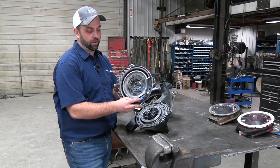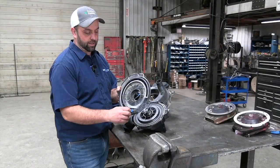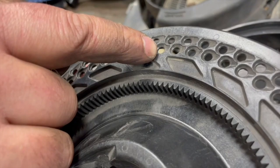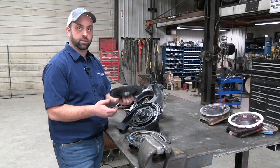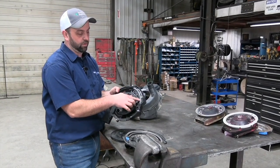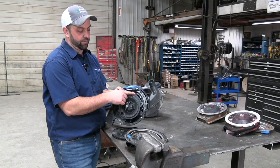Our second issue is our ejector wheel. These little stars — this is the wrong one for this plate — these little stars are going to run inside of our holes and knock out any debris that's left inside. We want to check that these are in good working order and that none are broken off. As we remove our plate and look inside, the plate runs on the singulator right here — check around here for wear and make sure our holes are not being elongated. A lot of times we'll find this is full of seed treatment, as well as our seal. It's good practice to use mild soap and warm water to clean these up at the end of the year. On this singulator, you'll see two raised notches on either end and the center is lower — that's our wear indicator. As this wears in the field, our plate will eventually start to rub on here, and that's a sign the singulator needs to be replaced. When these are half the original thickness, they need to be replaced.